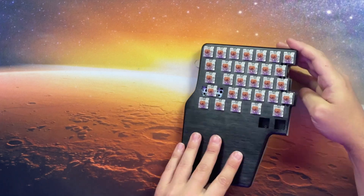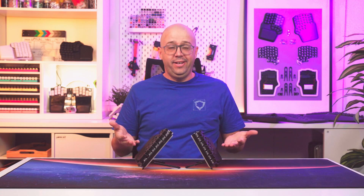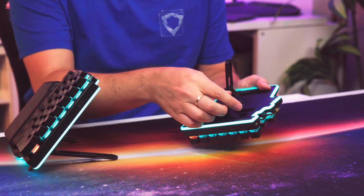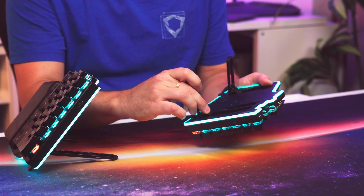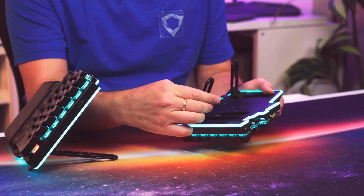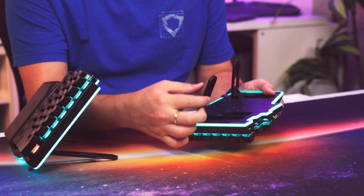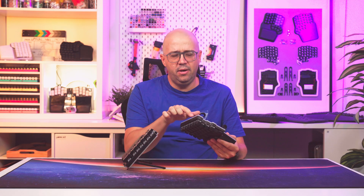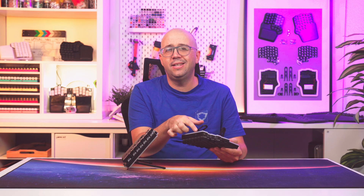What if we keep the idea of having two claws of different length but eliminate the sliding part? And here it is — there are two rods: one for 5 to 20 degrees and another one for 25 to 60 degrees. Each one is anchored on a fixed position on the aluminum leg and pivots on a hinge to reach the correct slot on the base. With this solution, the rods remain reasonably perpendicular to the base at all times, increasing stability.